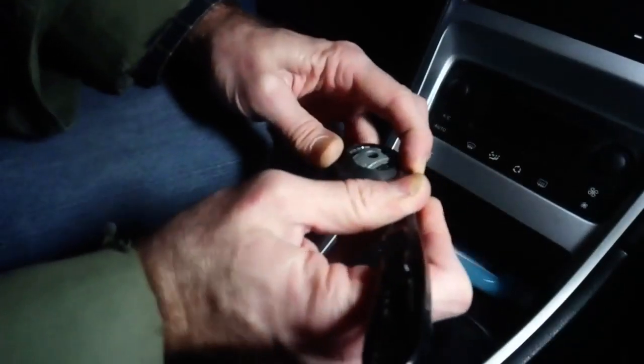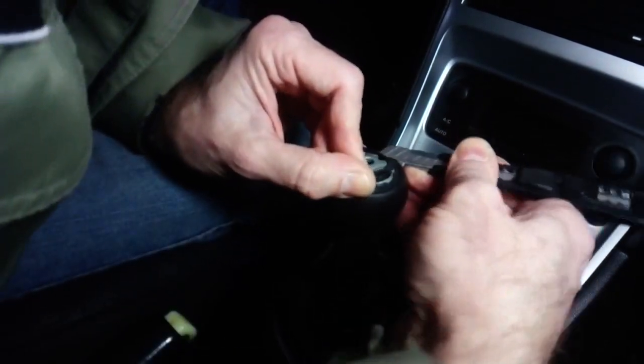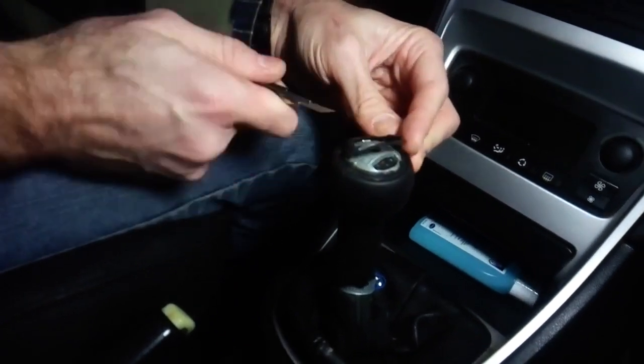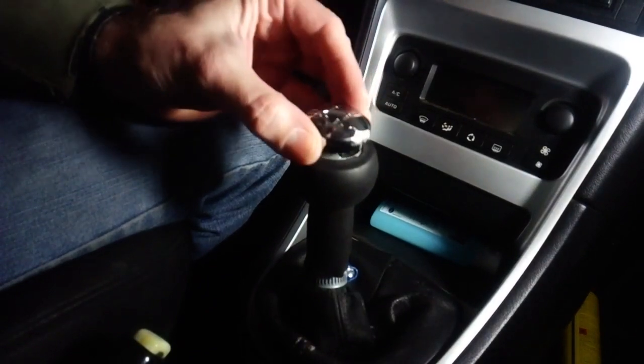The top may need some cutting to remove the excess material, and maybe even a couple of small cuts to accommodate the two ears of the top cap. Heat it up nicely and evenly so that it's very soft, and then immediately place the top cap and you're done. The heated tube will hug the sides of the top cap and it will keep it there almost like the factory part.